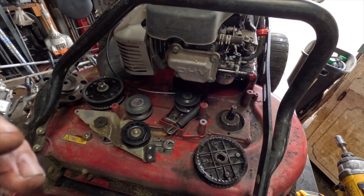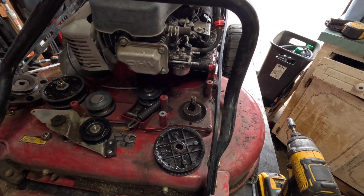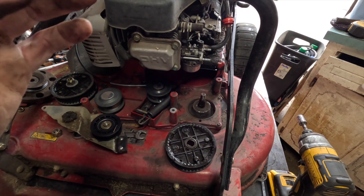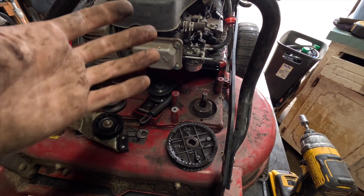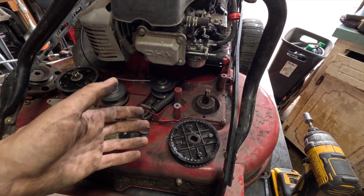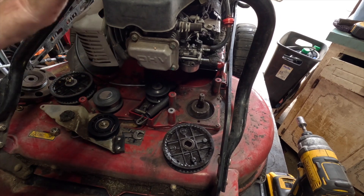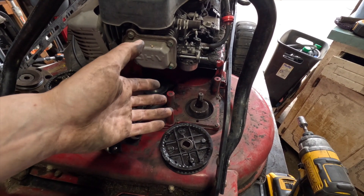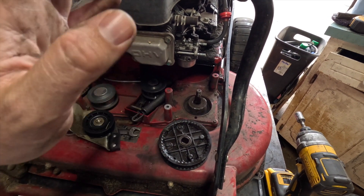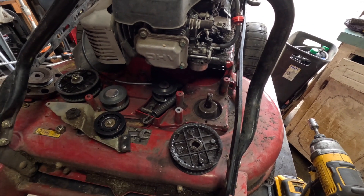What will eventually happen is it's going to fry this bearing and the bearing beneath it. That's not usually a bad thing in itself - those will go out eventually - but you're going to prematurely wear them out. And eventually if you do it long enough, it's going to break the whole housing. Then you go from replacing bearings to replacing the whole spindle - that's expensive. Just don't over-tighten it and you don't run into that situation.